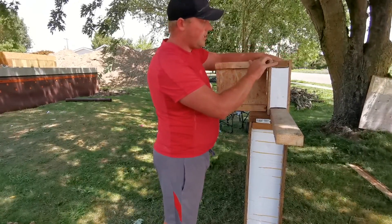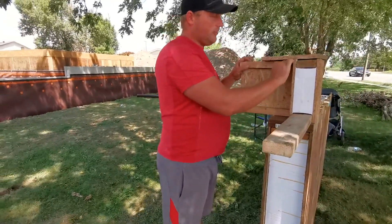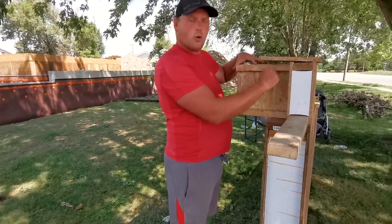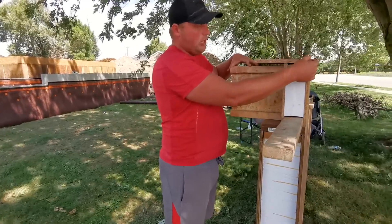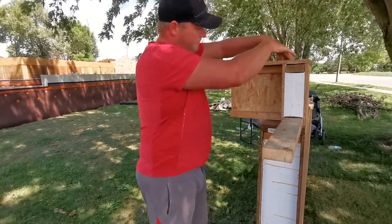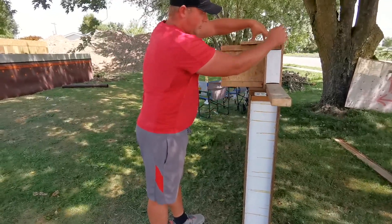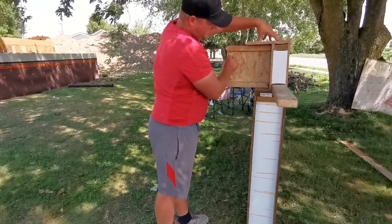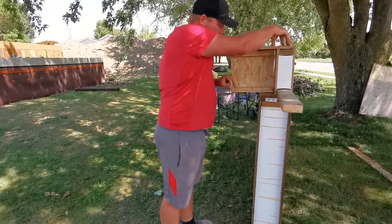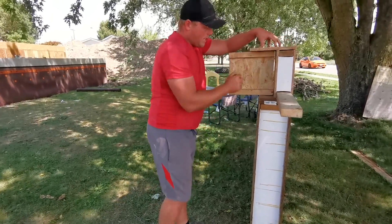The top plate was foamed and nailed in place. Then my subfloor gets glue — applied on the tops of the floor joists and on the outside perimeter to seal everything up — and then that gets nailed in. This gives you insulation, other than where the wood is, continuous all the way through to the outside, as well as strength for your wall to sit on. And that is the system that I used for our house.